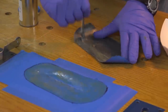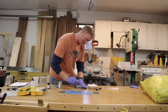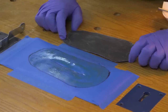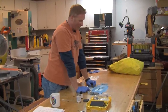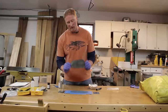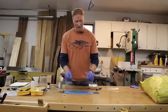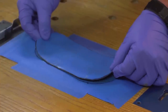Now we're going to reflash the patch side. I always find something out there to work on — like a cooler lid — because I don't want dirt getting into what I'm doing. I do this two times. The boat manufacturer recommends three times, but I've never had a problem doing it twice, and I've had some pretty horrendous holes. This is a contact cement, so you want to get your ducks in a row before you do this. Once you touch it, it's staying where it's at. That's why I like the black magic marker trick — I can truly see what's going on.